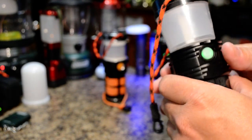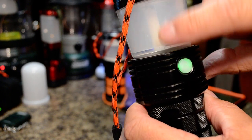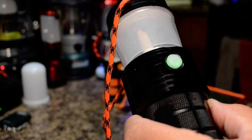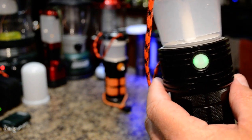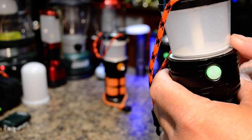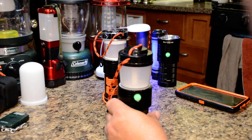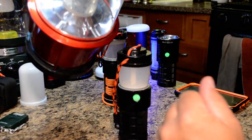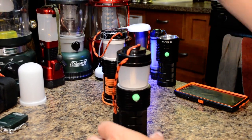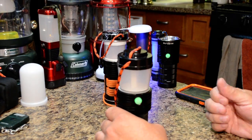The bottom inside is painted flat white, as is the cover around the center tube, the top surface around the LEDs, and the star itself. I've tested chrome, silver, brushed aluminum, gloss white, and other surfaces, and flat white appears to be the best for reflecting light and creating less hard light and shadows. A lot of factory lanterns come with chrome surfaces on the bottom and top — the problem is that chrome reflects the LEDs exactly like a mirror, creating hard light beams and glare.